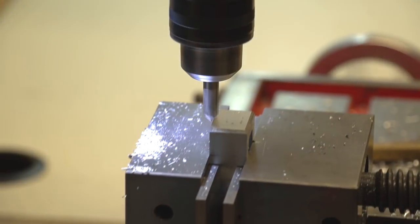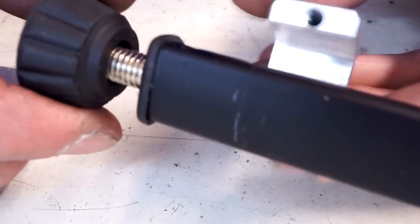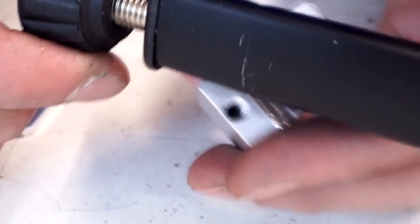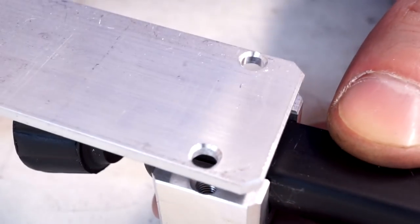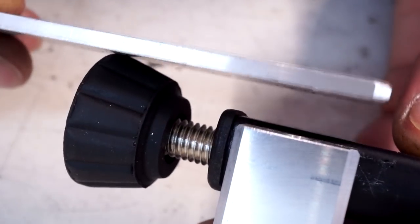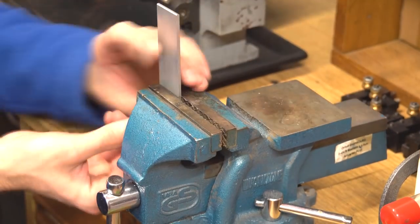The part got really sharp edges, so cut it before the blood runs out. I also make 2 M4 threads in it, but I was still overthinking and forgot to record. Anyway, looks like the part fits the monopod. But there comes another problem — the monopod leg is too big and I don't want to cut it away. So I must bend that camera holder part twice to avoid the gap.